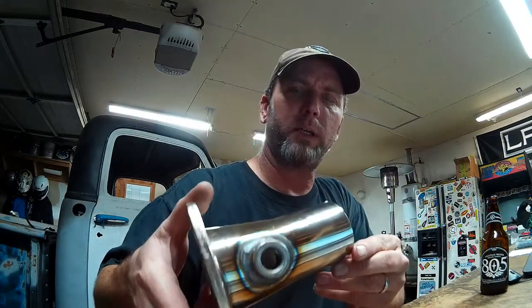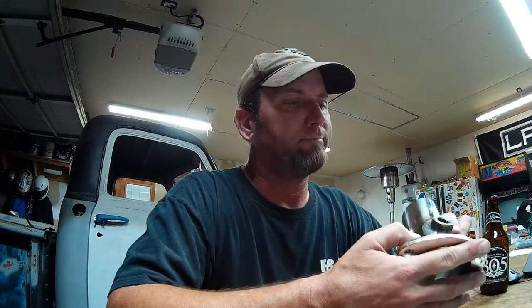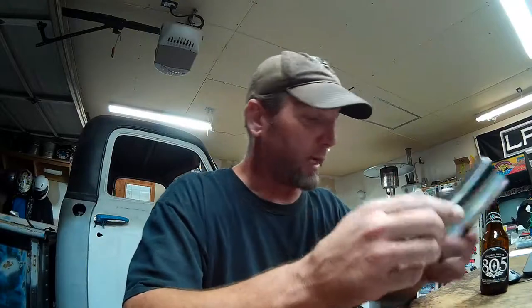The bung for the collector came out just fine for our O2 sensor. I undercut it quite a bit. I think I'm not used to using 1/16th inch filler and a 1/16th inch tungsten, and I wasn't adding enough filler metal. Usually I weld mild steel with 3/32 rod and 3/32 tungsten, and filler isn't usually a problem, but with 1/16th inch you have to add a little bit more, especially if you're running hot on something like this. So I ended up undercutting the bung a bit on the sides. Fortunately, it's super thick, and it's not going to be a problem. So everything looks great on that.